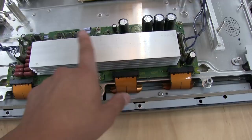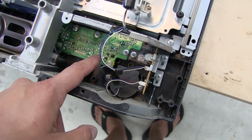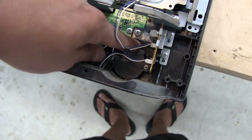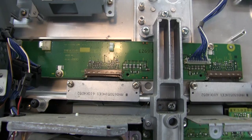Inside we find the usual assortment of boards you'd expect inside a plasma TV. There are a bunch of IGBTs and maybe some diodes on this heat sink, a little control board up here, something that looks like it might be for the remote, and a power button on this other board. There are some little covers down here — looks like they're just insulating. It looks like there might have been a smaller speaker, maybe like a tweeter, but all this model has are these six-ohm speakers.